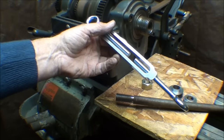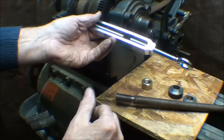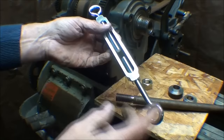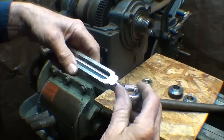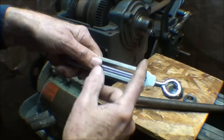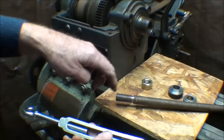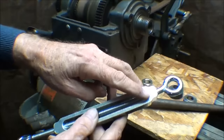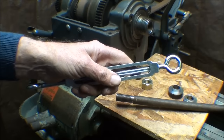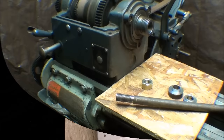I'm trying to think out of the box and think of other solutions. If you do not have a left-hand nut and all of that, here's another thing you can do. Get yourself a heavy-duty turnbuckle — you can get those at the hardware store — and you don't want a cheap aluminum one; this extruded aluminum one has no strength at all. But on a steel one you have a right-hand thread on one end and a left-hand thread on the other. You have a nice piece of left-hand thread right there, and it can be cut off — that is your nut. Yes, you're going to have to do some fabricating and maybe welding, but I just wanted to tell you a source of left-hand threads and nuts. That'll be $12 for that one. So I'll leave the rest of that up to you.